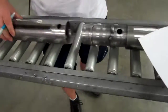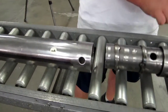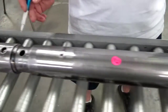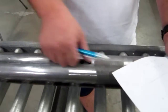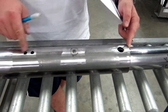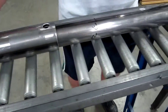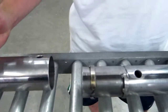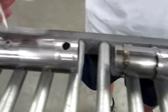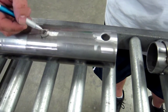Pull this apart here — exact same thing. This section is the same as down there other than it doesn't have the hole through here, but it has a pin welded through here, just like down there. These are 2 holes that go all the way through for hardware — 16 inches from here to here, and 3/4 of an inch from here to here. These are 3/8 holes. This is the stud going all the way through. It's 6 inches from the side of the pin, which is half the diameter plus 6 inches, to where this hole goes.